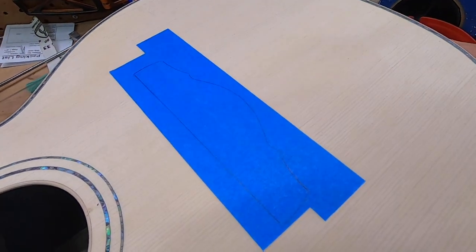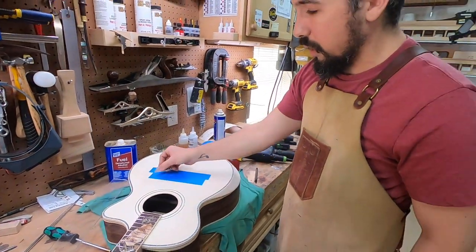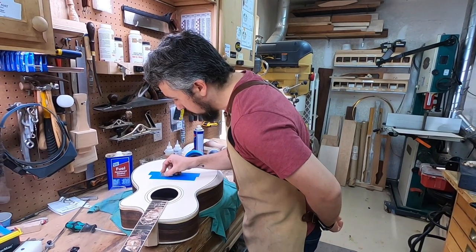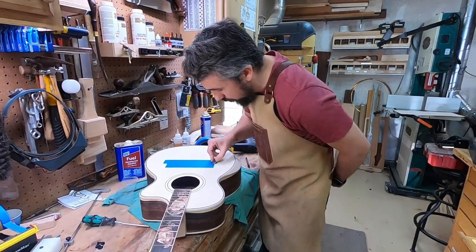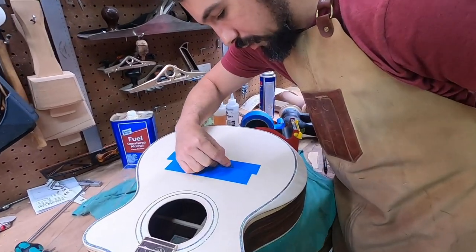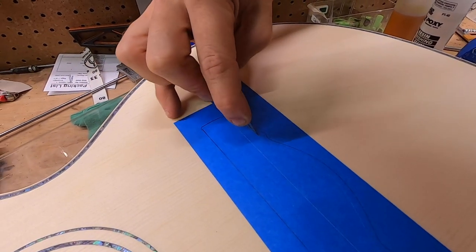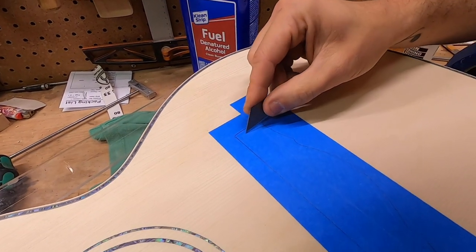So that gives you an idea. Now what I'm going to do is actually cut this back, but I'm not going to cut to the line — I'm going to cut back about almost a quarter of an inch. Can you see where I'm razor blading in relation to the actual pen line? I'm not touching it, for two reasons. A: I don't want to create a ridge.